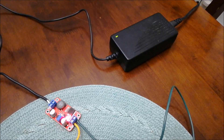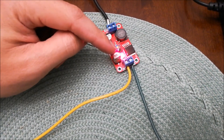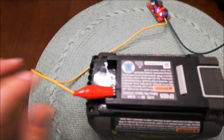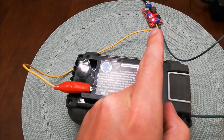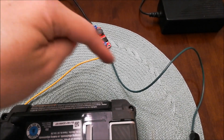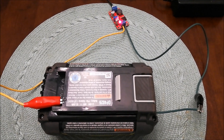This is a 12 volt 3.5 amp adapter. You have the 12 volt come in — positive, negative — and then you adjust this voltage, when it's plugged in, to 40 volts. Then you plug in the battery leads. I soldered up some wires so I can charge multiple batteries. The positive wire comes off the converter to the positive lead, and the negative wire goes to the lead that we created. If you let this sit for 15 to 20 minutes, it will bring the battery voltage up to where the battery will be recognized by the original charger.